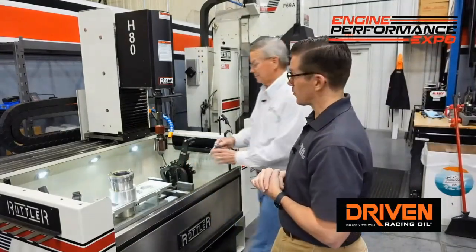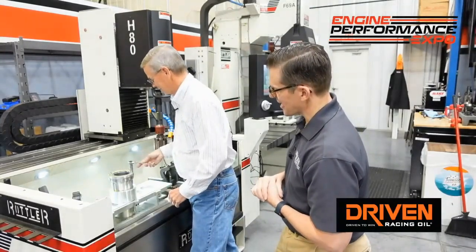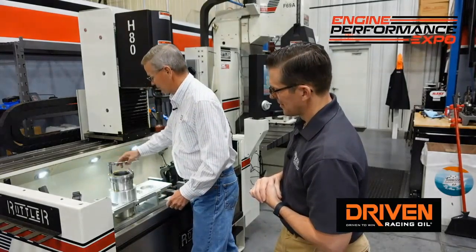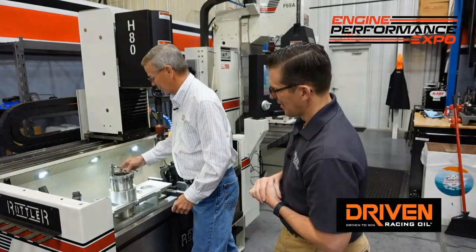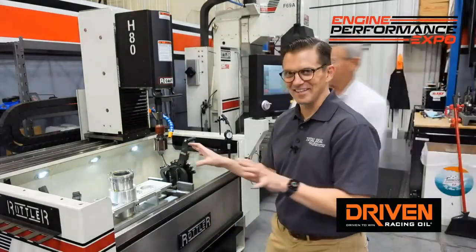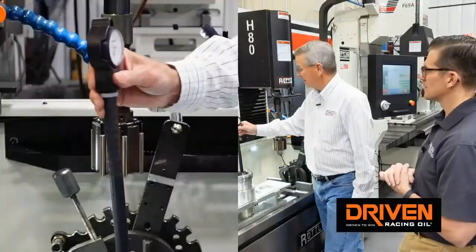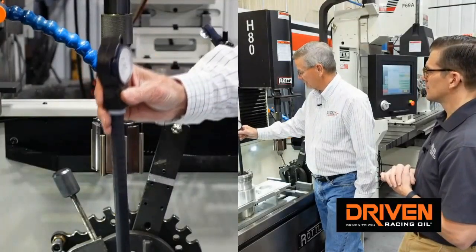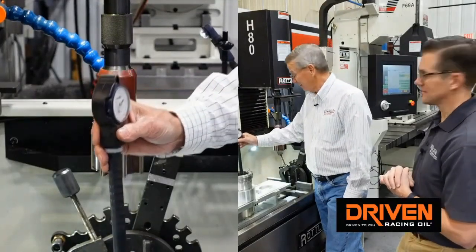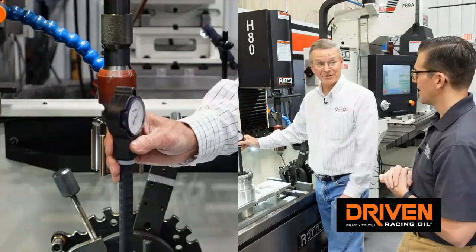Now I'm going to grab a wrench and just take the pressure off. All I'm going to do is take the pressure off — which you can see is really a quarter of a turn, so you can see that we didn't load that much. Now we're going to go back in, and we should be pretty close at the top. And we're going to be eight tenths tight now in the middle, and then we get to the bottom — a thousandths and three tenths tight.